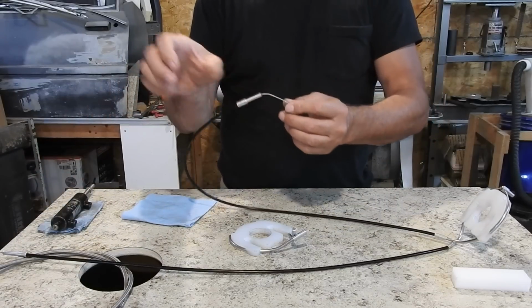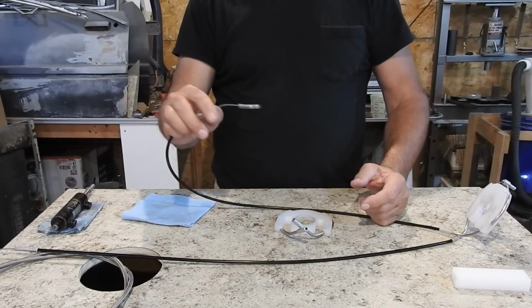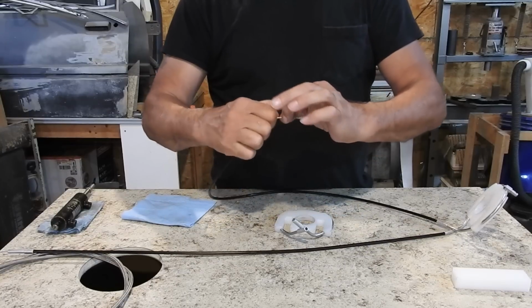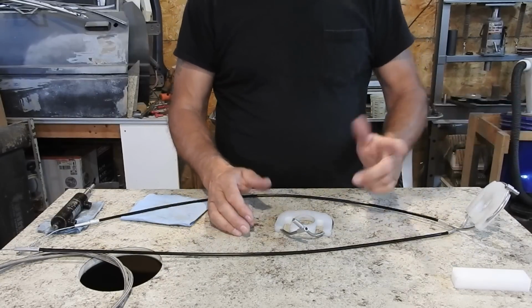You could grab the rudder and you can move the rudder and the wheel would spin, but it was reluctant to turn because it was too much friction on there. But once I got out and started to taxi it, these springs were too soft for that, and all I was doing was compressing this spring without really moving the tailwheel. So the tailwheel wasn't steerable yet, but I could still ride the brakes and it still worked like it normally would without it.